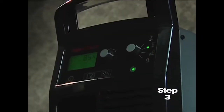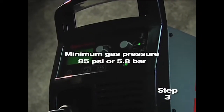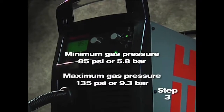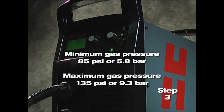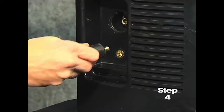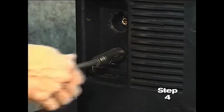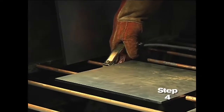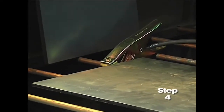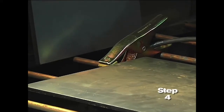The minimum gas pressure is 85 psi or 5.8 bar and should not exceed 135 psi or 9.3 bar. Fourth, attach the work clamp to the power supply and securely to the workpiece. Rust, paint, or coatings must be removed to ensure that the clamp has good electrical contact.